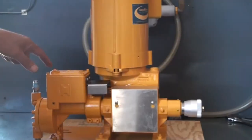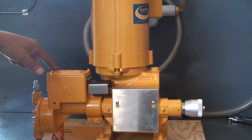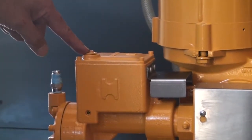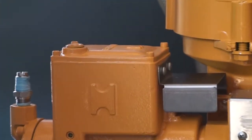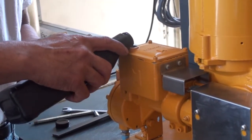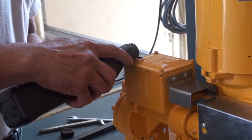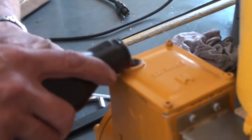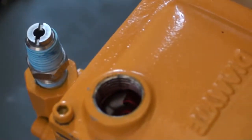The oil bottle marked hydraulic type F needs to be poured into the pump housing. The diamite's pump housing has one three-eighths inch pipe plug located on top of the pump's cover. To fill the pump with hydraulic oil, first remove the pipe plug and pour the oil carefully until the oil level is slightly above the brass internal relief valve adjuster.